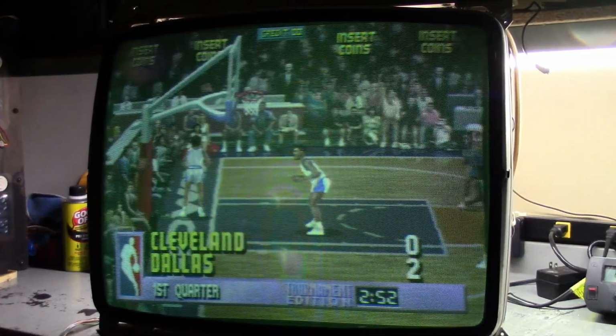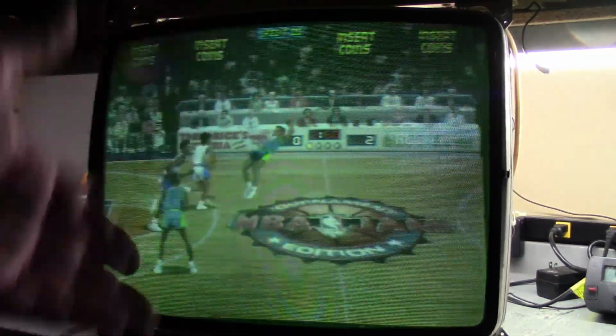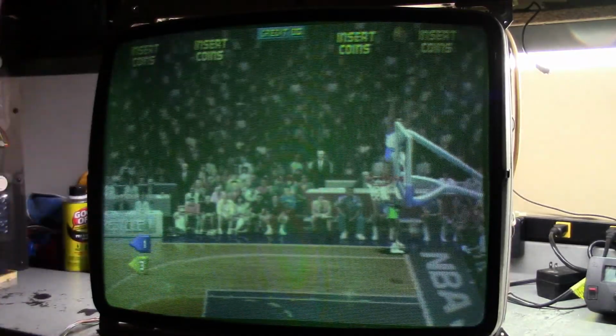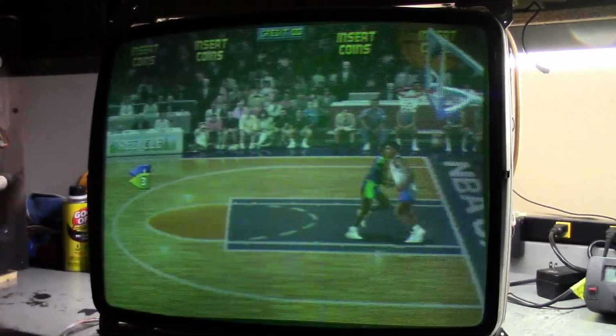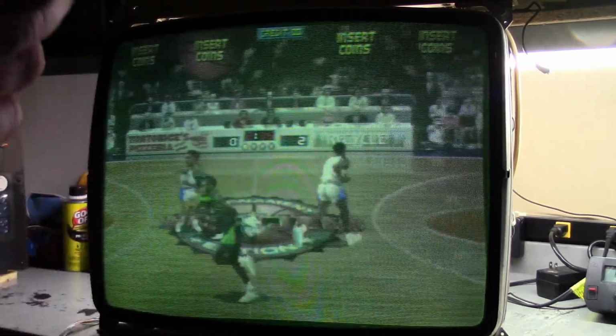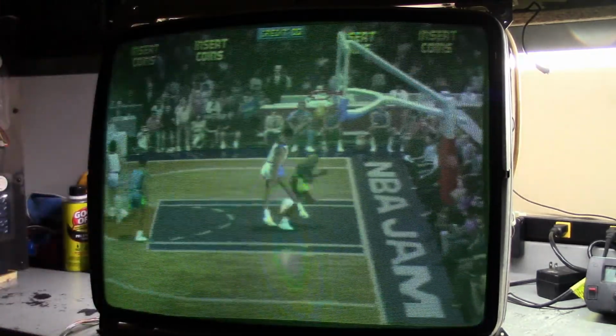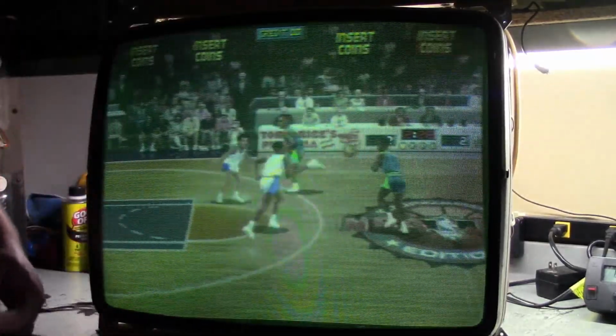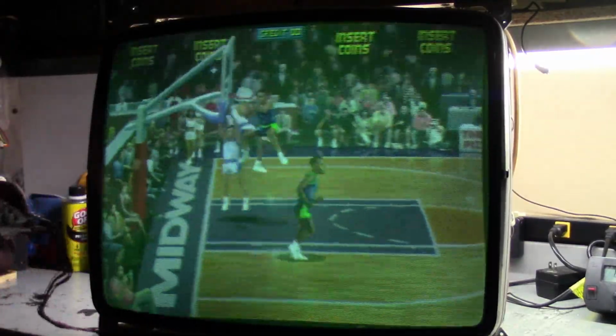I was completely unaware that the chassis will operate with a shorted D13 if R91 is open. If R91 is working and D13 is shorted, it will not operate. That's a learning experience for me, and I assume probably for you guys too. But okay, so again, let's try this from scratch.